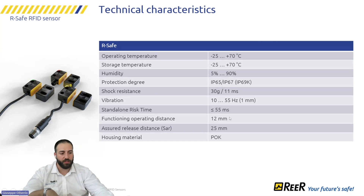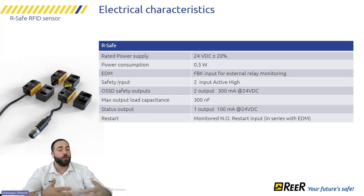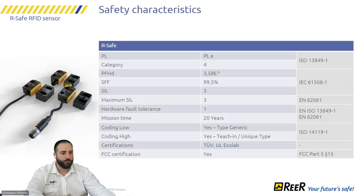The active field is up to 12 millimeters, and the assured release distance is 25 millimeters. The sensor features a feedback input for external device monitoring, a safety input for configuration or serial communication, and a dedicated reset input. The sensor can be used in applications up to Performance Level E or Category 4.